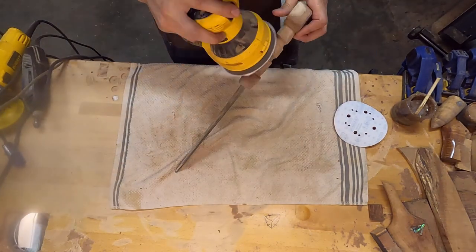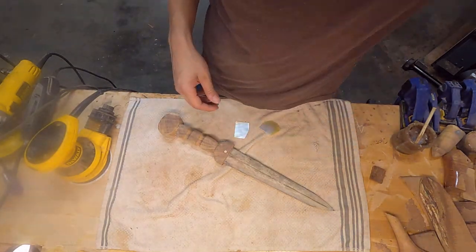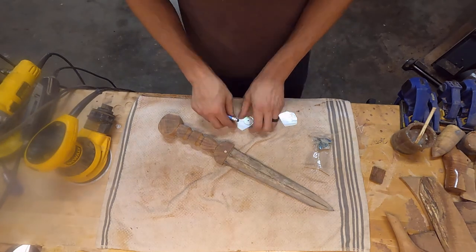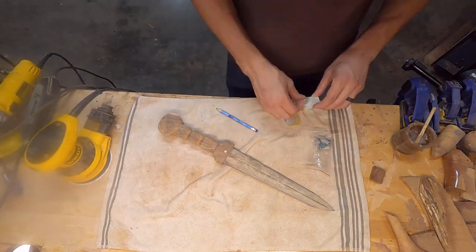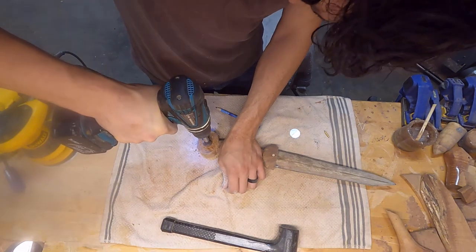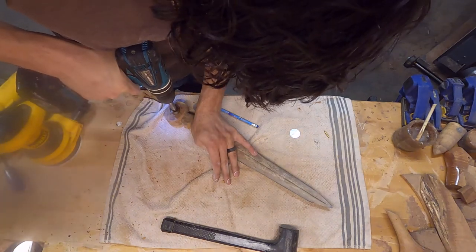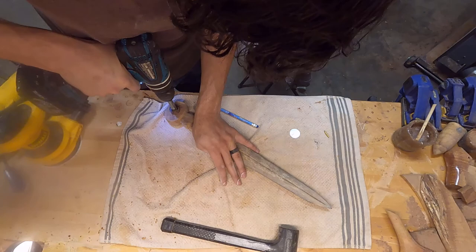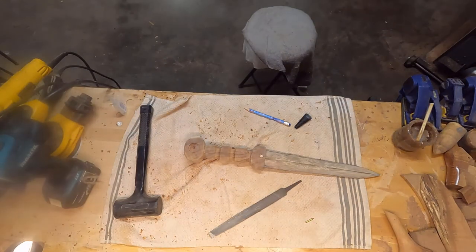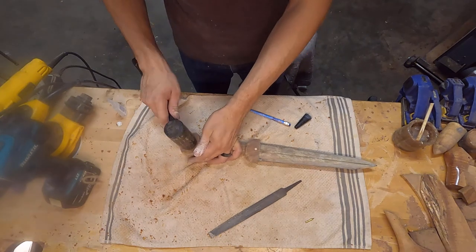The next step is just going to be lots and lots of sanding with some corrective back and forth. While I was working on it, I wasn't overly pleased with how the pommel was looking — it just looked too bland — so I wanted a little bit more contrast in the piece. I decided to put in some mother of pearl inlay — white and gold mother of pearl. They're just shell chunks, so I have to shape them down. I'm using a one-inch bit to cut in the recess, then I ground down the shell shape to match that bit so I have a very clean edge. You have to go really slow grinding it down to make sure you have a nice true fit — otherwise you can get big gaps. Once I got it to a nice snug fit, I went ahead and used super glue and pounded it into place.